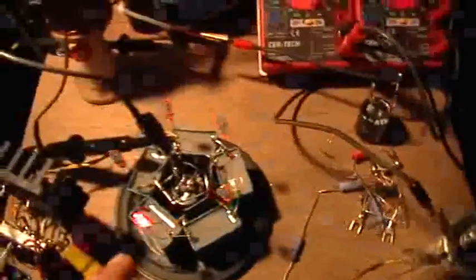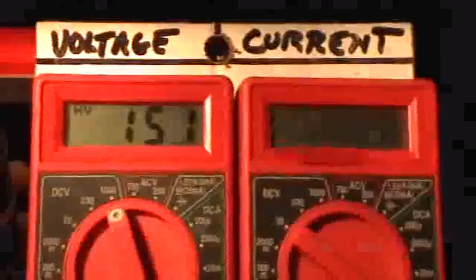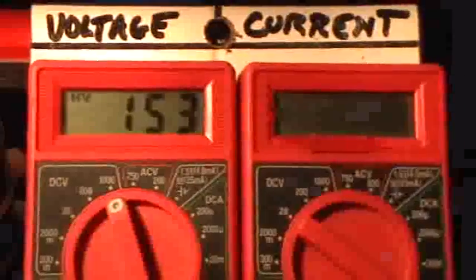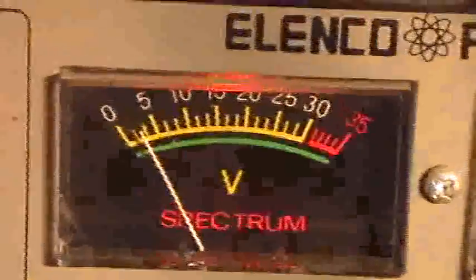It's running the ring oscillator and we've gotten the external capacitor charged up to 150 volts and still climbing — and that's just through simple half-wave rectification using a single diode, so we're actually wasting a lot of power there. The charge rate has slowed down a little bit, but what happens if I increase the voltage up here? Let's go all the way up to five volts.